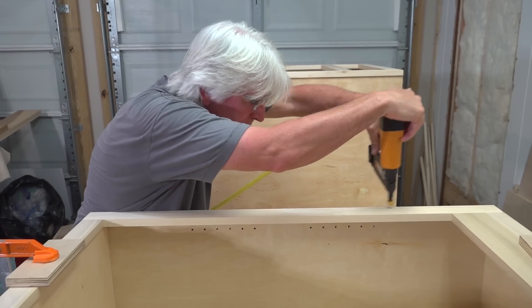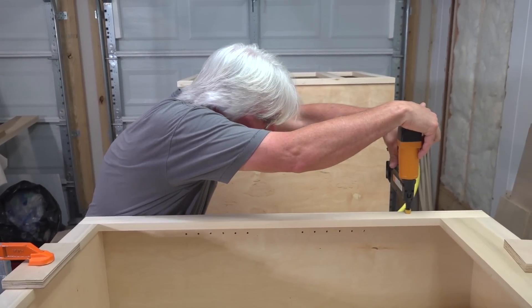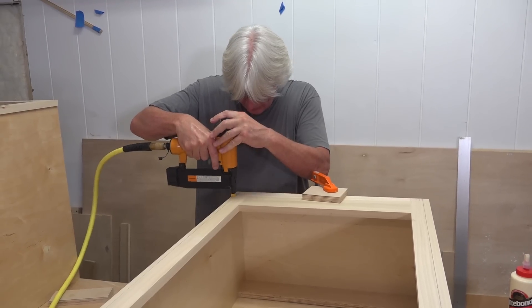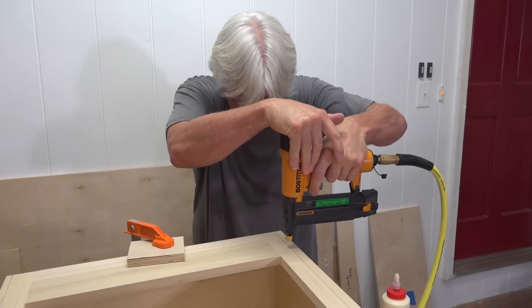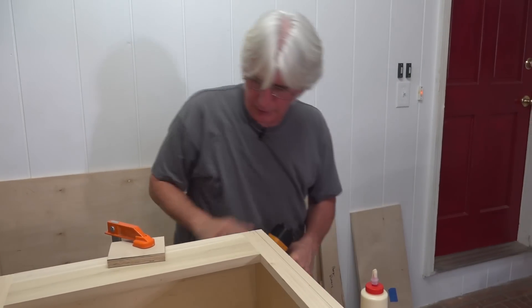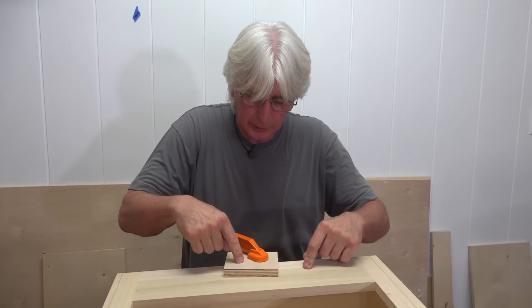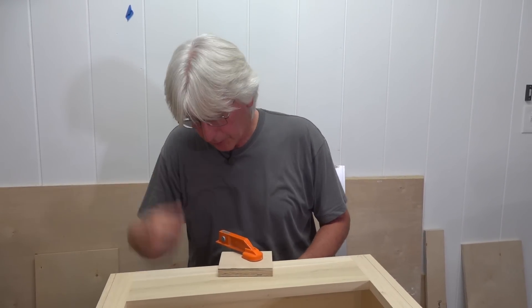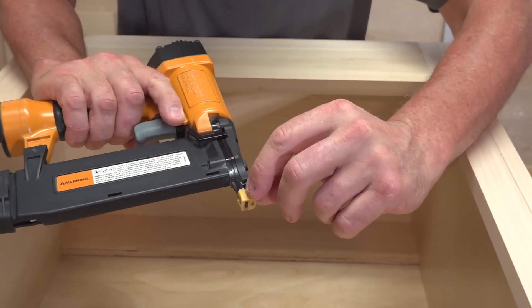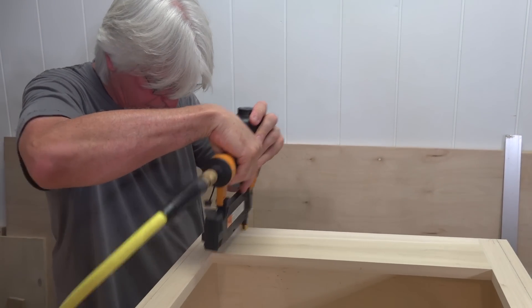Every so often, make sure you didn't mess up. Just kind of randomly sticking the nails in — you probably don't need this many, but I do. I know there's a nail or screw going here, here, and here, so I'm going to go between them. I kind of push down on the gun to help pull that wood together, make sure everything's good and tight. These boards were setting good and flat and they're straight. Sometimes you'll have a little bow in them — if you do, you need to clamp them where you're nailing just to hold them down tight.